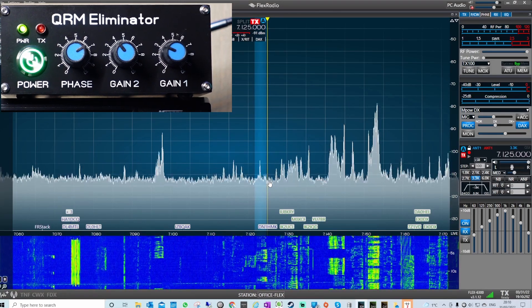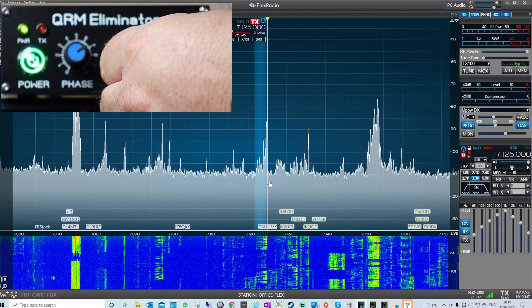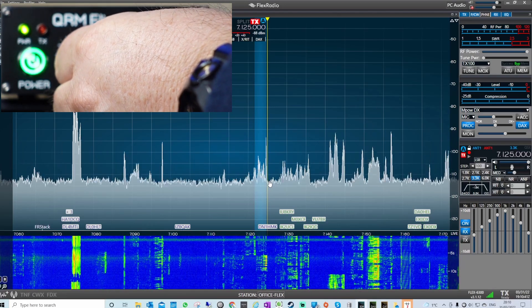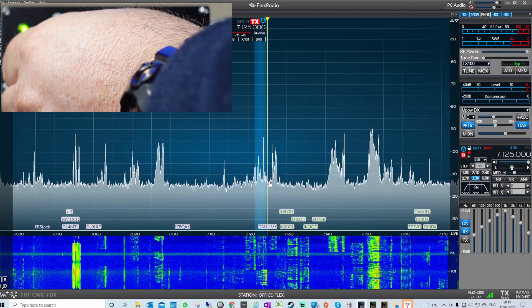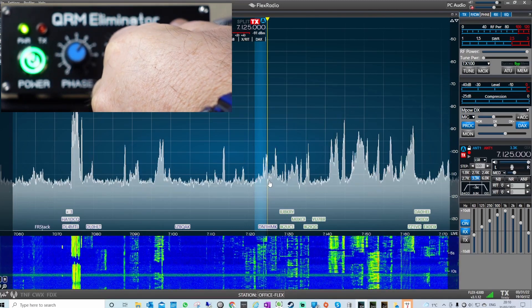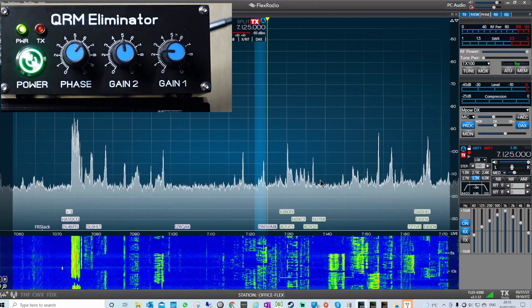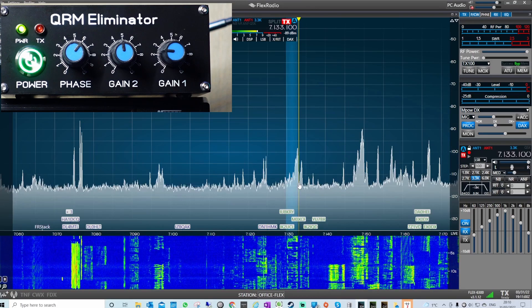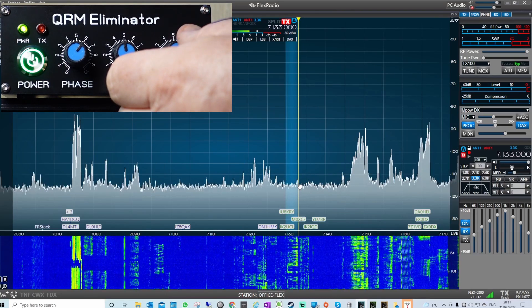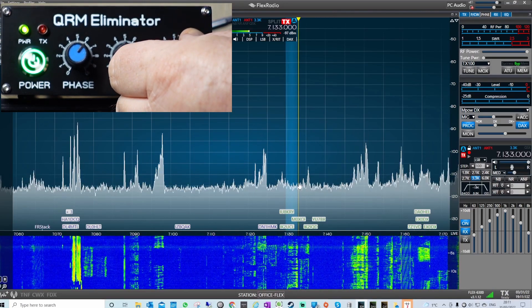I have got a feeling that my transmitted signal is much better than my receiving. I actually did get to a stage a few weeks ago where I was receiving a station through an SDR 40 miles away, but transmitting to them from here — just because the receiving SDR had a much quieter and lower noise floor. I'll switch it off in a minute and you'll see what the noise floor is here. I mean, it's S9 most of the time on 80m.